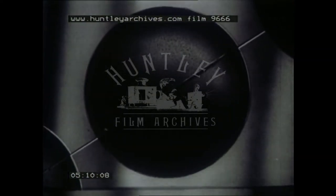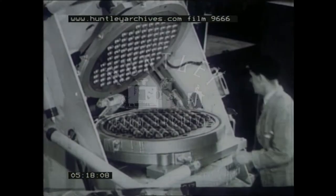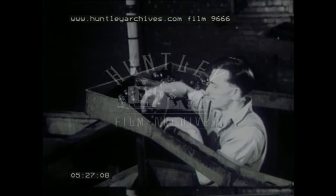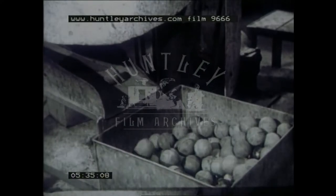That's why at the beginning of the film, we told you that there really was something inside the ball. The press is opened again and the cores are removed. Next, they're prepared for covering by a machine that rolls them around between two emery discs, giving them a finely roughened surface ready to take the adhesive solution for fixing the cover.